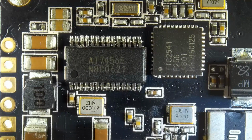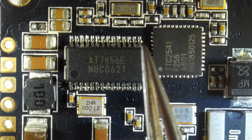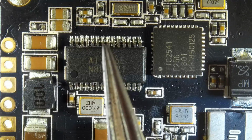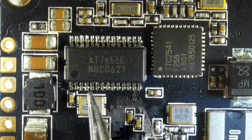If you're curious which one's the video input, since we're here, the video in is pin number 22. So for pin number 22, we would go up here and count 15, 16, 17, 18, 19, 20, 21, 22. So it's that guy right there, I believe. Maybe I counted wrong, but it's pin number 22, which is around the middle area. Yeah, it would be the most middle pin, because each side has 14, and it's pin number 7 basically.